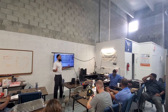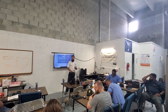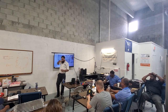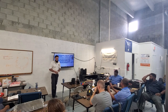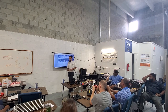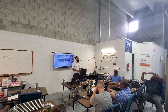Now the system is completely empty. It does not have neither nitrogen nor freon, but it has oxygen. What's our next step, sir? Vacuum. What is the vacuum pump? What's its purpose? Take the system into a vacuum and see if it holds.